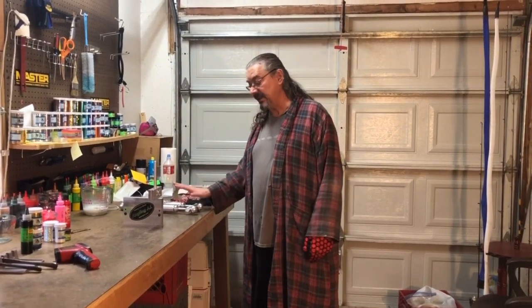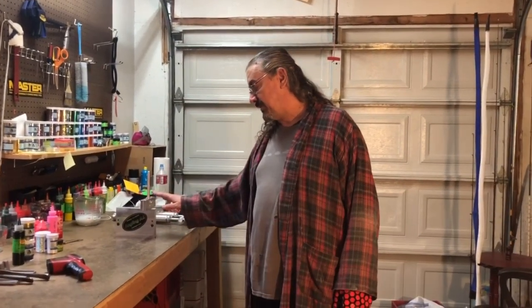I've already preheated the mold and the injectors and the blending block. With it being chilly in the garage, if I don't do that, I'll end up with dents in the outer part of the baits, so preheating them helps a ton. If you're using the rods when you shoot, you also want to make sure that the rods are heated up too. The rods take up right at half of the gate — the gate is where the cavity meets the runner. If that gate freezes off, you get dents. So heating the rods and the mold helps ensure that the gates don't freeze off too quickly.